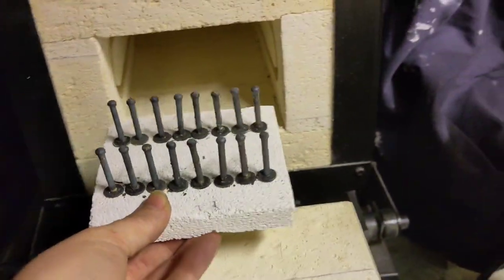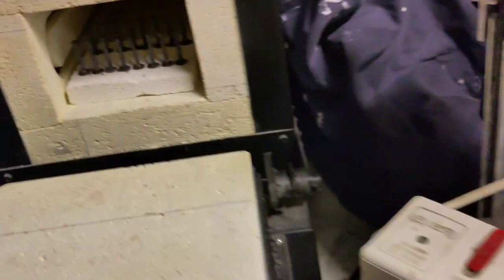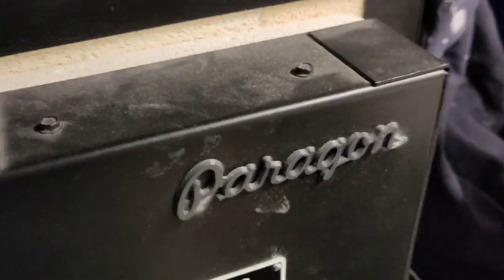I normally heat treat multiple blades at once and they all stack in a certain way. I've also got to remember this is stainless steel, so it's going to be foil wrapped — with this expensive foil — meaning it's actually going to be bigger than the bare template. So I definitely need to spend a little time thinking about that before I cut it out.